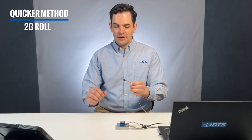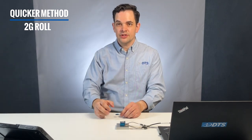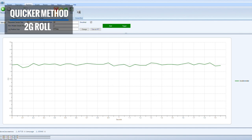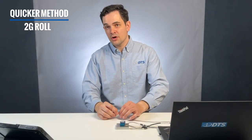There's actually a quicker way to run a 2G roll cal. Take your sensor and rotate it so it's acting up and down — let's say you've rotated it so it's looking in the negative direction, then zero it here. Now if it was supposed to read negative 1G and you've zeroed it, the software is adding 1G to make it 0, so you'll see a flat line at roughly 0G. Then if you rotate it back to positive 1G, it'll show positive 2G. It's just as valid as the previous method, but faster — you can see a simple pulse that goes to 2G on your oscilloscope. If you're running this test on a bunch of different accelerometers it can save time. Just make sure you make a note of how you did it and how you zeroed, so people have confidence in what they're looking at.